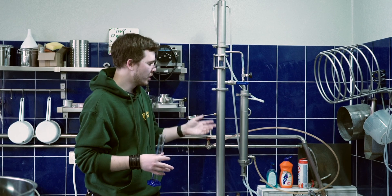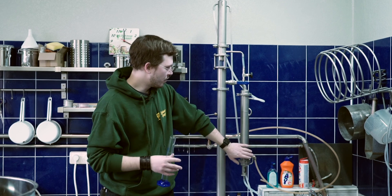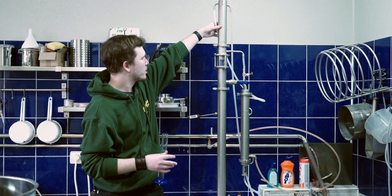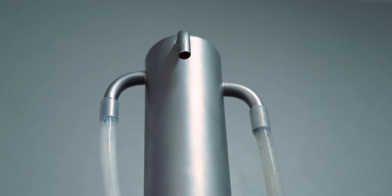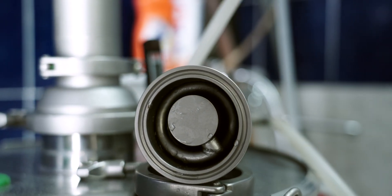Very simple to use as you see. When you have power up to 2000 to 3000 watts, you can still use this distiller. The amount of water you're taking is really small because you have a very powerful condenser — on one side a spiral Graham coil condenser with a spiral around a cold finger, as we call this thing.